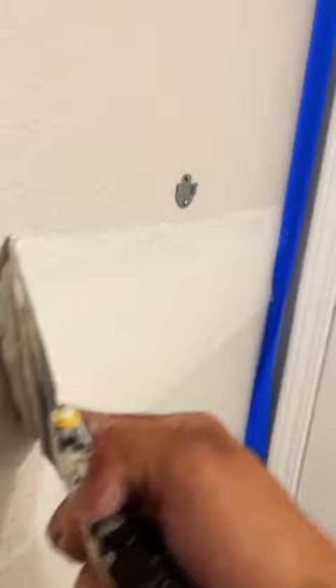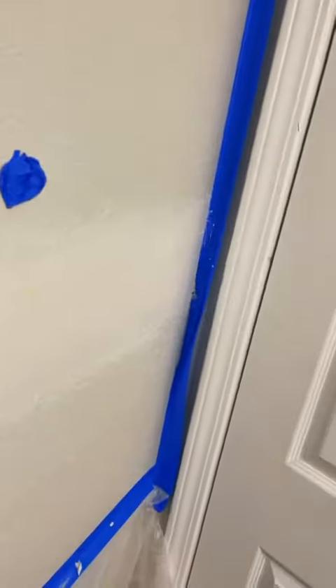This is just the final touch-up coat — make sure there's no imperfections, it's super smooth. This is a very important step: don't forget this one where you wipe the edge down. That way, when you shoot the texture, it's not going to be noticeable or you're not going to have an edge and see the patch there.